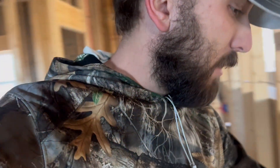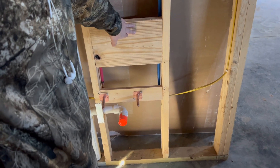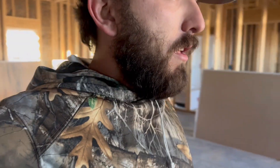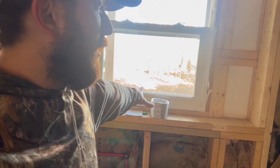A little bit of a side quest here. My parents are building a couple houses right now, and I bet you guys didn't know I'm also a part-time carpenter. I put this brace board in here for a shop-style sink because the construction crew forgot to put one in. This front window opening was like 36 by 32 for where the sink goes, but they decided they wanted a 42-inch wide window. So I took out the bracing, built a new header, and made it so the guys can drywall it — then I'll take out this window later and put a bigger one in. Technically you could say I built this house. I gotta get back to the shop.